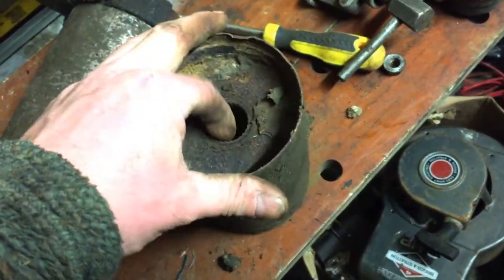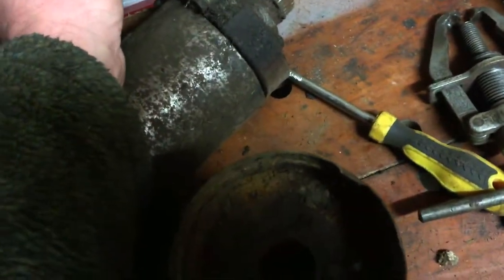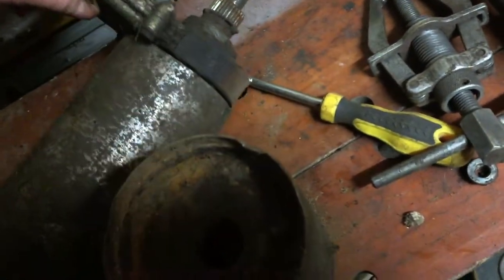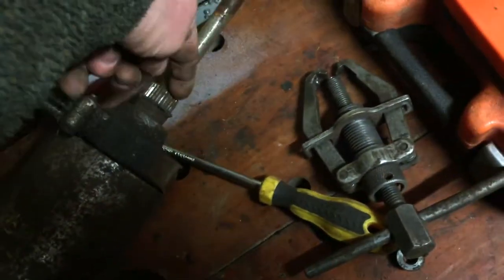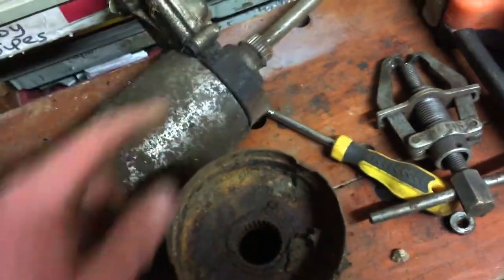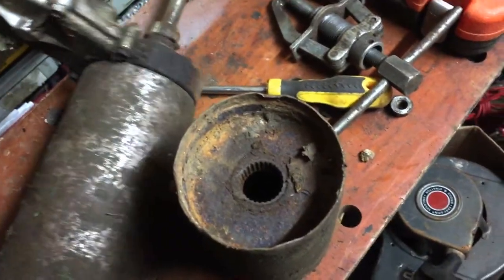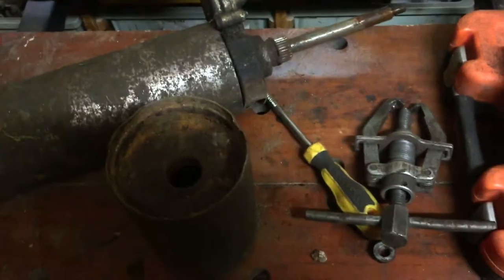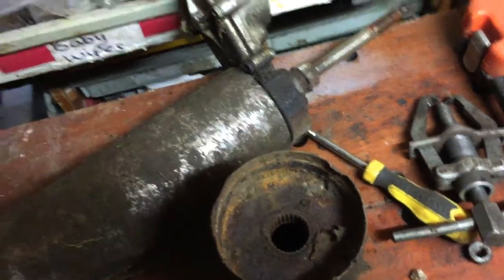The roller is in okay shape. The stones are not in there now so I'll clean all that off. That's where I slightly bent it but I'll straighten that out. The little spline bits are all okay. The central needle bearings seem okay — there's no play to speak of. They will slip along a little bit from side to side but they will do that. But if you hold the main shaft straight and you can twist it, then the needle bearings right inside have got to be replaced — that's a bit of a tricky job, or you can buy the whole shaft with them already in.